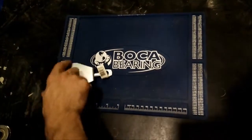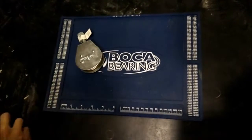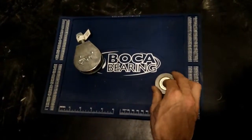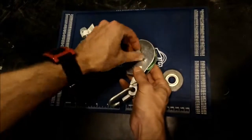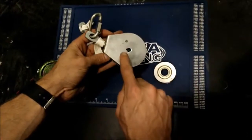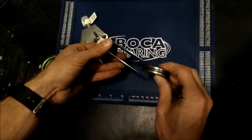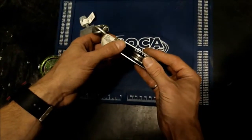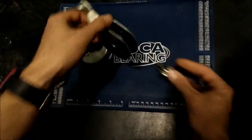So we have our standard pulley that we got from Home Depot. It's meant for rope, but the problem is there's way too much friction. So what we've done is we've got some bearings from Boca Bearings — these are called grooved bearings, so they have this nice V groove in them. And then we're going to use that Kevlar rope we talked about to support us. To convert it, we're actually going to take apart the old pulley and use the housing with the new bearing. We're going to have to drill this hole out to fit a shaft of this size, put a shaft in with a cotter pin. The other problem is the Kevlar rope could slip out and catch on the bolt, so we're also going to make some recessed washers which will snap onto the ball bearing in order to keep the Kevlar rope from slipping. Let's start building.